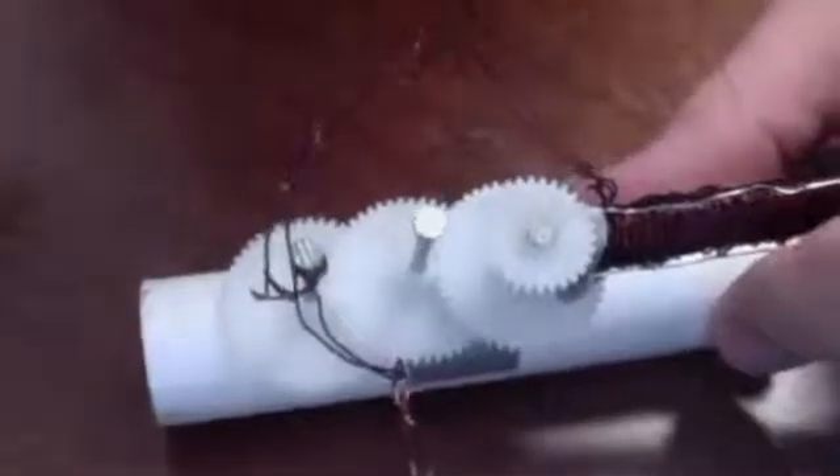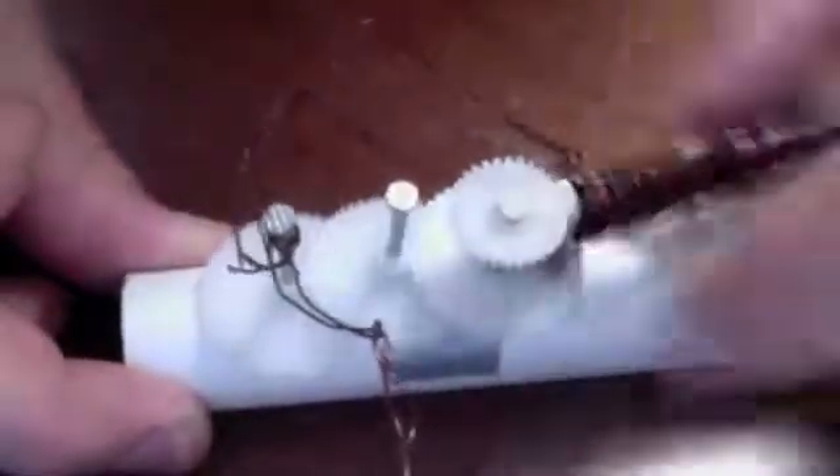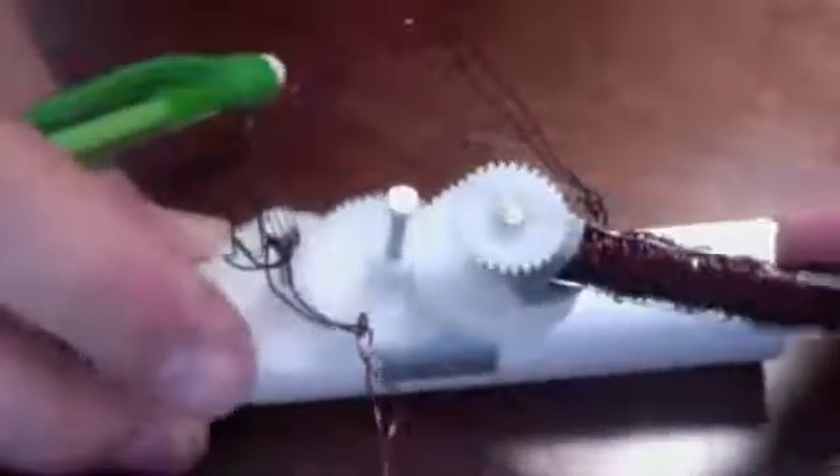Gears. What's so special about gears? Why did I use gears? Well, I'll tell you — it's the gear ratio. The gear ratio is the number of teeth of the following gear over the number of teeth of the driver gear. This is very special because it changes the speed and the power of the gears. For example, the gear right here can spin very slow, while this gear spins very fast. That is because of the gear ratio — big to small — making it spin a lot faster, but it's a lot less powerful.